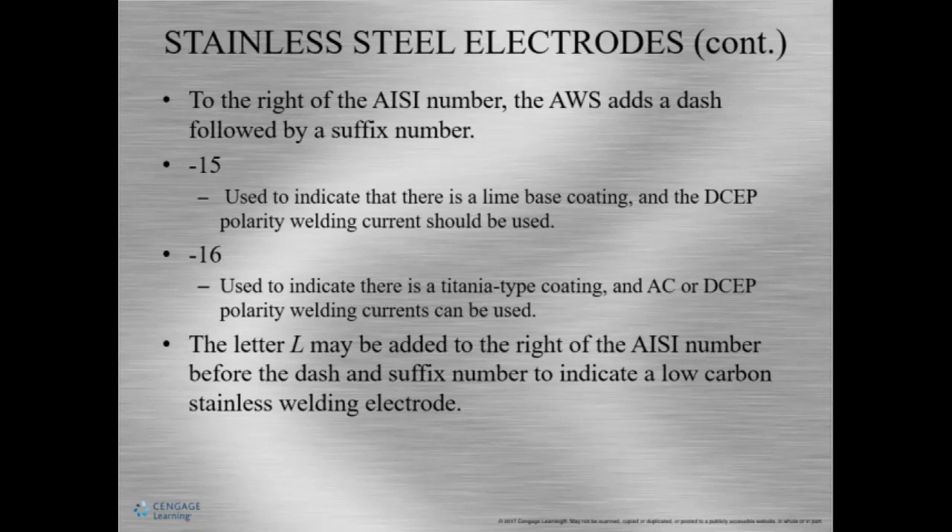The letter L can also be added after, indicating low carbon — so for example, 316L: there's my E or R, 316 is the number for my stainless steel, and L means low carbon. I also need to preface this next section: we can weld stainless steel to mild steel — this is considered dissimilar metal welding. This means I can weld stainless steel to mild steel, but the stainless steel properties will only be on the weld if you're using a stainless steel electrode or vice versa. The stainless steel properties don't combine — they're just there.